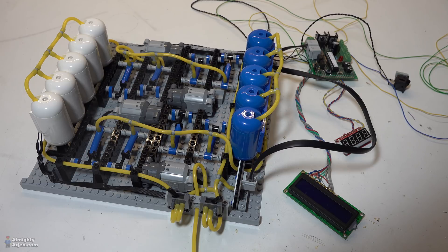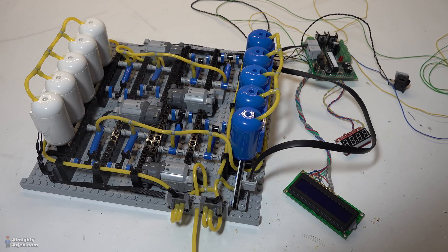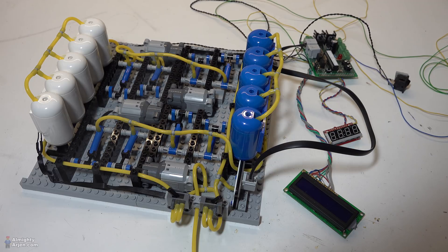I added another nice feature: the runtime of the motors. I took apart the old compressor and had no idea how many hours it had run. So I built in a function where, when the motors start, a timer starts, and when the motors stop, the timer stops and the values are saved into the flash memory of the microcontroller so they won't be erased when the power cuts off. By pressing this button you can see the display showing the runtime per motor.